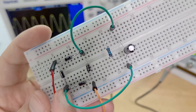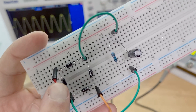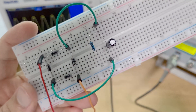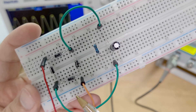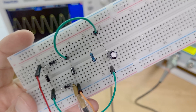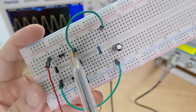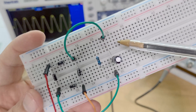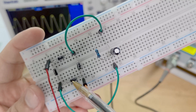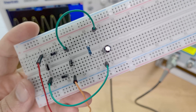So obviously it could go this way when you're looking at the diode, because you can see that the top end - the colored-in diode bit, the blocking bit - is there. But remember that current just wants to take the quickest route to ground, so it doesn't make sense to go back around in an infinite loop. It's just going to go back along here and then to ground. So the whole path: comes in here, goes this way, comes along here across the capacitor and the resistor, across this green wire, back this way, and then down to ground on the orange lead.